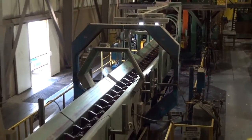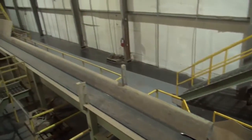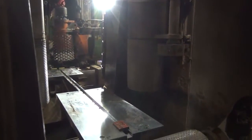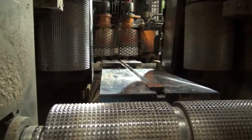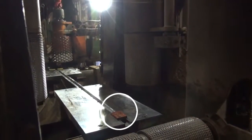With the stand and instrument installed, we turn our attention to defining the reference datums. On every machine center, we start by defining a particular machine characteristic as good — sometimes a rail or a sharp chain, possibly some points on a frame or subframe, or some other appropriate machine feature. For this project, a keyway on the lower anvils provides the reference datum, and all other machine components will be aligned to this feature. A point is selected at each end of the keyway to align the jig transit to the machine center. A target block seats into the keyway and defines the actual centerline, consisting of a notched aluminum block provided by the original equipment manufacturer specifically for alignment.